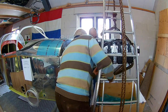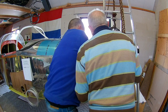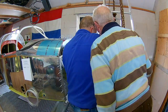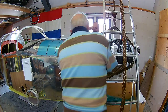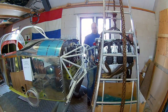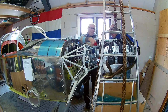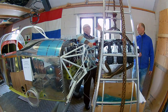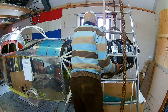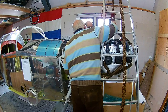It turns out it's very hard to get the engine in because of the rubber mounts, which have a very good fit. I greased them a little bit, but they were still hard to get in. The trick is to get your airplane level — by lifting the tail, I could get the right level so all the rubbers go into the engine mount parts.